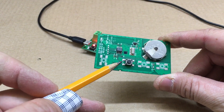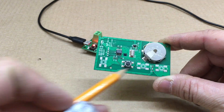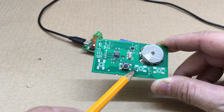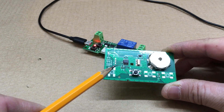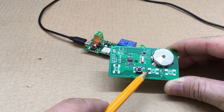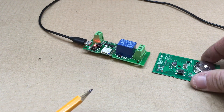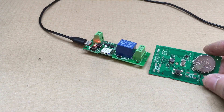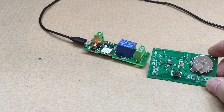You can take your actual garage door opener — this one isn't programmed to my garage door yet — and on the left side are the solder joints we're concerned about, because they're the ones that make contact. If we solder wires to the normally open and common terminals, we can wire this up and control it from your phone or tablet.